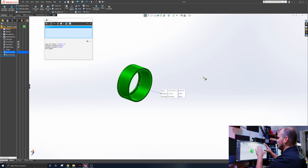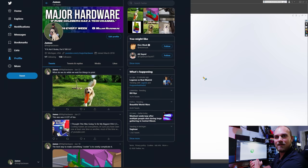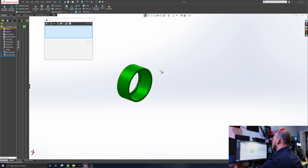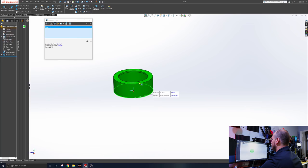You could drop a wacky, goofy fan design and tweet it at me on Twitter. And I guess if I get a whole bunch of designs, I could probably pick a few good ones and print them out and have a little subscriber show-off, see who makes the best and goofiest fan. But yeah, you guys wanted this hub. So once again, 41.3 outside diameter, 37.3 inside diameter, and the total height of this hub is 16.5.